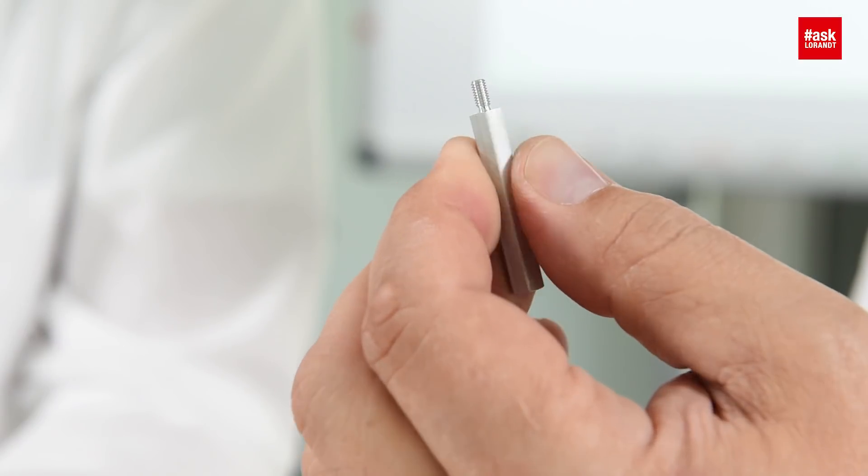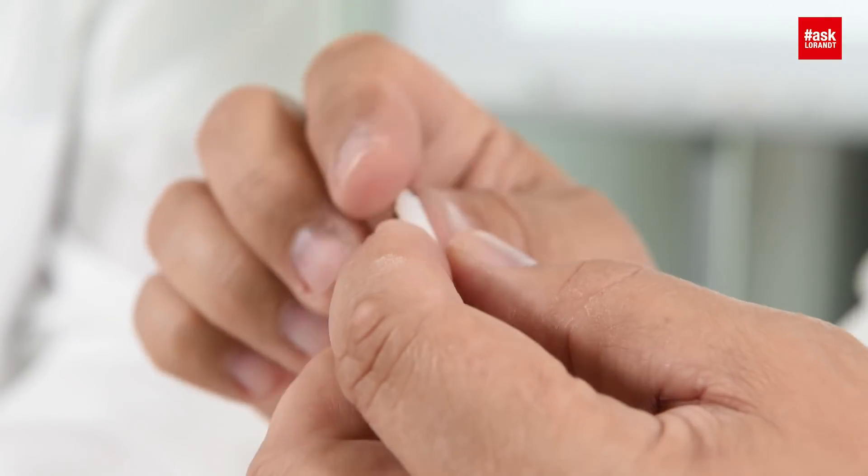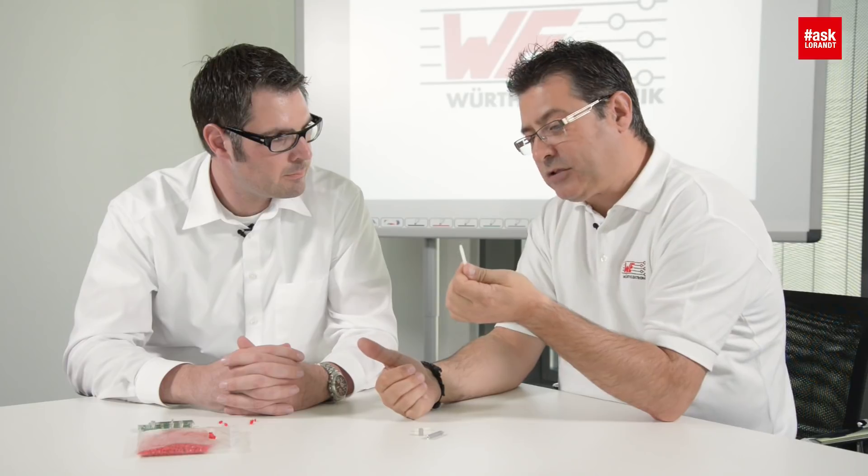I have a situation in our production because we're using two different PCBs and they are connected with a holder like this. This is a spacer which has to be screwed by hand, and our production engineers say that in mass production it's quite complicated and takes too much time. So I had the idea to use this plastic spacer which has on one side snapping and on the other side sliding - it costs less and goes faster.